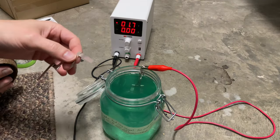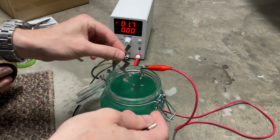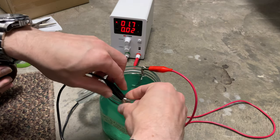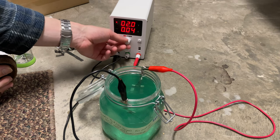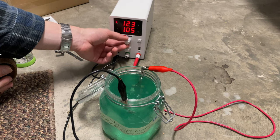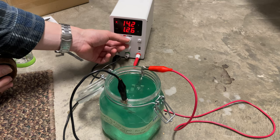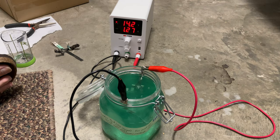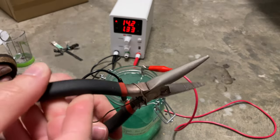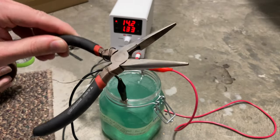I'm gonna regenerate the nickel bath a little bit here mid-cycle. I made a small nickel tree with five small nickel strips and I'm gonna lower that into the bath to make sure I've got good electrical contact. Cranking up the current, we're gonna saturate the bath with nickel ion — up to around 12.8 volts, even 14 volts like running a car — which will absolutely saturate the nickel bath. Mid-stream, pulling the part out for a few minutes causes it to start rusting because of the acetic acid and sodium chloride in the nickel bath, so it's absolutely important to rinse your part with deionized water as soon as you pull it out.